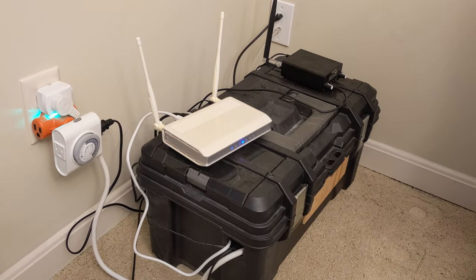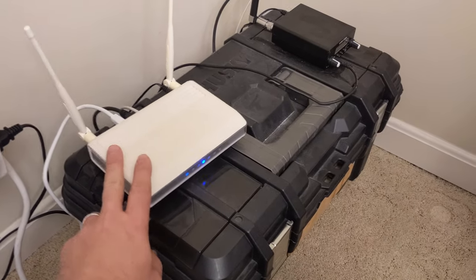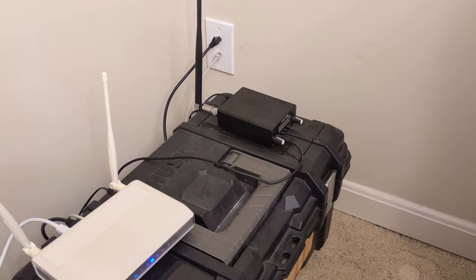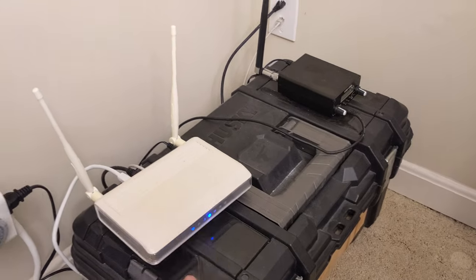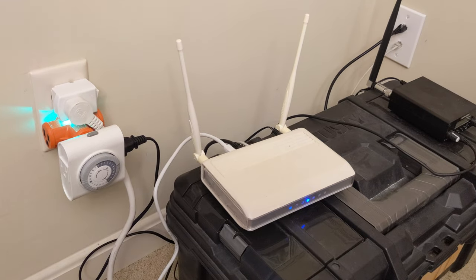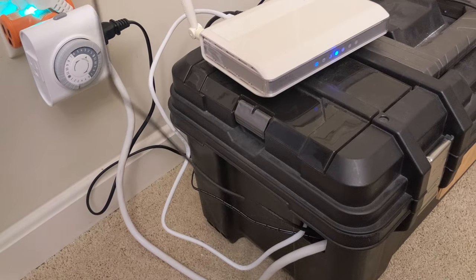Starting the tour of our light show is the center — the brains of the show — which is composed of three different pieces: a router, a radio transmitter, and inside the box is the Raspberry Pi. The router is a self-contained network, separate from my home network, so all the network traffic is isolated. The radio transmitter broadcasts the show's music out to the audience. The router and the Raspberry Pi are always on, hooked to the box's power supply. I have a little switch here so I can easily turn it on and off. The radio transmitter is on a timer so I'm only transmitting during the times of the show. The Pi is connected to the transmitter from the audio jack through a cable.